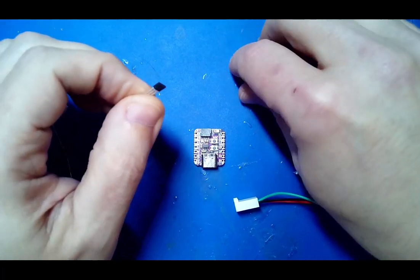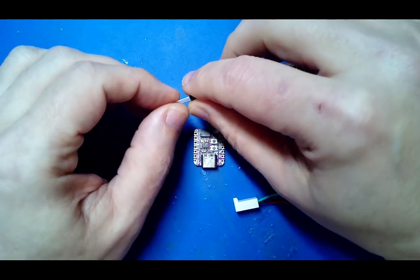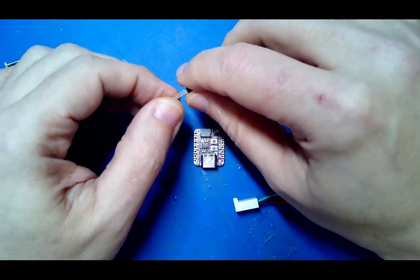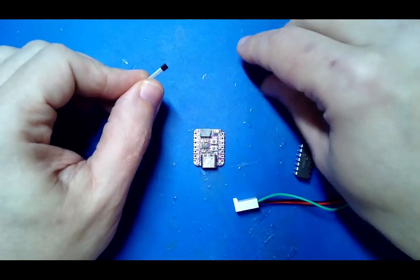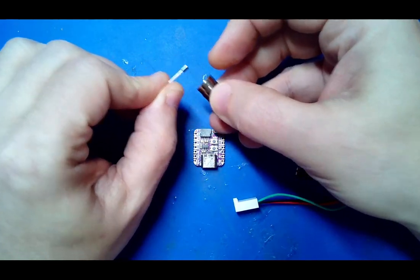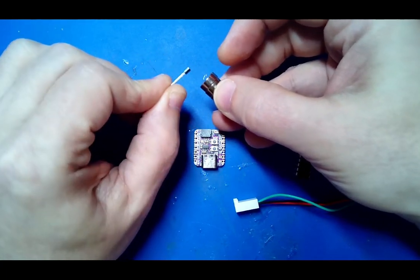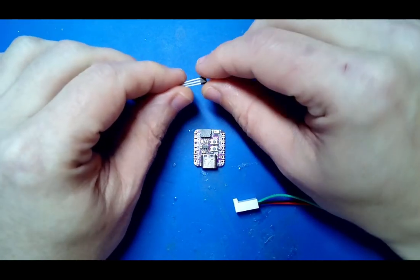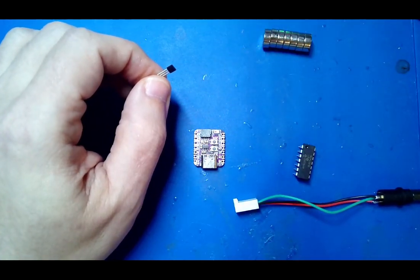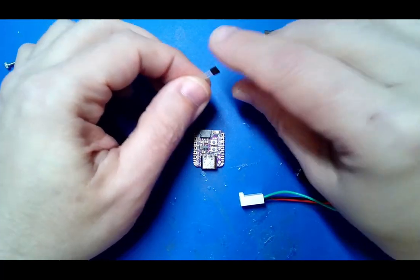range. So what you're looking for is generally called a 49E type Hall sensor, and that is an analog sensor. So it outputs analog values depending on the strength of the magnetic field. So the closer it is or the further away the magnet is will determine its output. Well, you say, great. Maybe that sounds like a potentiometer to me. I could just wire it in. Well, no, it's not that easy. Of course, it's not that easy.